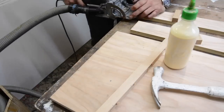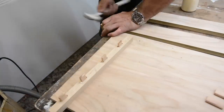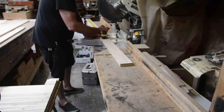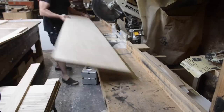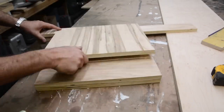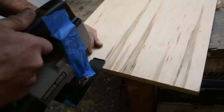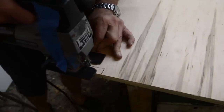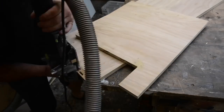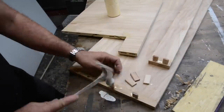Each end of the seating area is going to have a hardwood corner, and here you see me inserting a piece of oak. This is going to be on one of the broad sides and then I will use the domino joiner to add it to the opposite side — so two sides of the corner. Now I have to consider that the whole area where this is being installed has a shoe molding at the ground. This is why I keep cutting this profile into everything. When I go to install this I'm not going to cut the shoe molding out — I'm going to leave it in place and just accommodate my build to wrap over it.